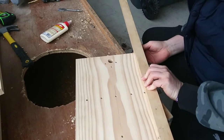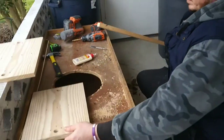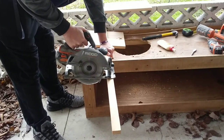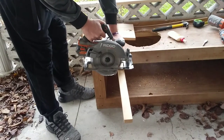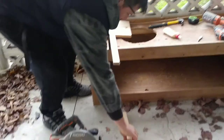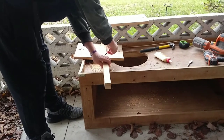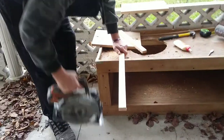Remember, before you cut your 1x2s, one of your ends is going to have to be longer than the game board, enough to accept the extra space of the opposing 1x2. I made my vertical rails the same length as the game board, about 16 inches, and my horizontal rails about 14 inches, a couple inches bigger than the horizontal length of the game board. That way it covered the extra sides of the 1x2s. Unless you want to miter a 45, and then, well, I didn't feel like going through that trouble.